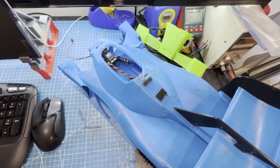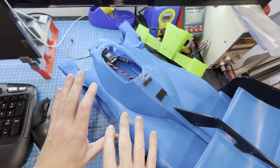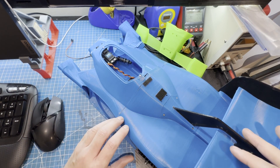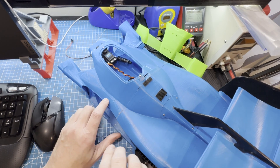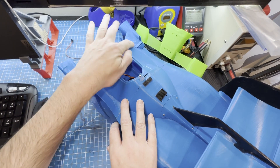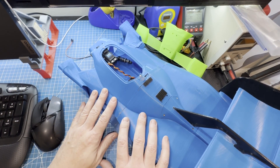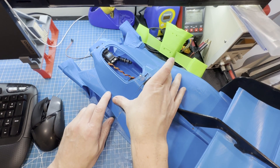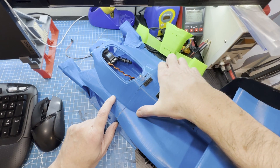Moving on to version 2's body — I had a lot of different changes throughout the entire body. I spent a lot of time on the cosmetic aspects, just better aligning the seams and body lines so everything flowed a little nicer. I dramatically increased the width and height of the monocoque to make more room for the electronics and additional ESCs when I add all-wheel drive, which weirdly actually slightly improved the overall downforce for the car.